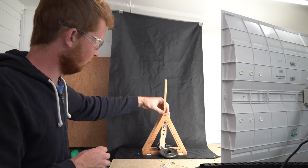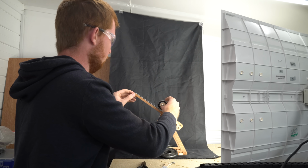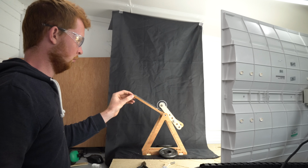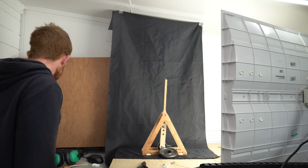The counterweight is attached in a similar way using a pivot, but the largest difference is its launch position. The longer arm, which the projectile is attached to, is rotated nearly another 180 degrees past where a conventional trebuchet arm would be released from. This raises the counterweight up and above the main axle, and therefore increasing the gravitational potential energy, similar to the fixed counterweight trebuchet. But when released, the counterweight comes to almost a complete stop, just like the conventional trebuchet.